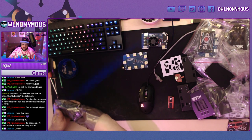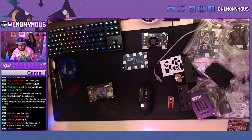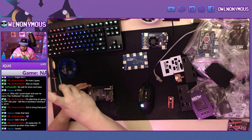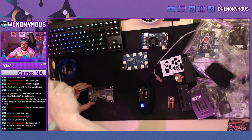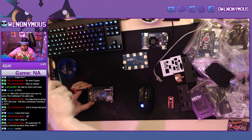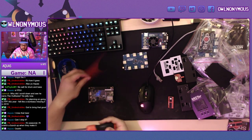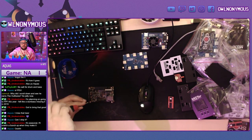Alright, so you just take out the main DE10 Nano here. You're gonna remove this top shield. If you're going for more of a budget build, you can repurpose this clear piece on the underside, and use longer standoffs and mount your USB hub that way. That's what I did with my initial builds.